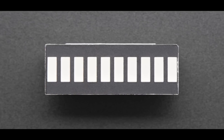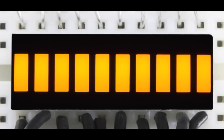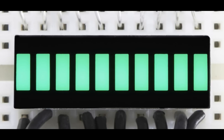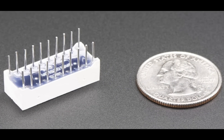We have a bunch of LED bar graph connectors — these are 10-LED bar graph displays. They're actually just 10 LEDs molded into plastic, and they plug very nicely into a breadboard. We have them in a variety of colors: amber, pure green (the bluer green, not the yellow-green), blue, and a really bright white. They're handy to use in a breadboard — the pins are nice and long with 0.1-inch spacing.